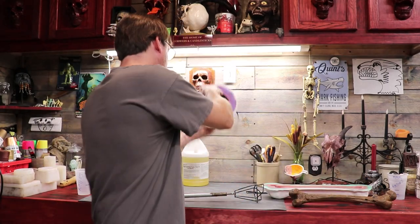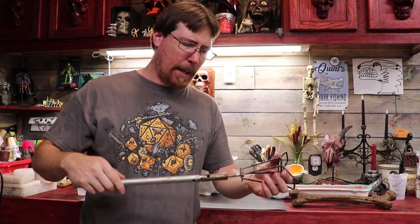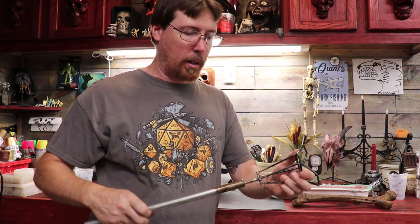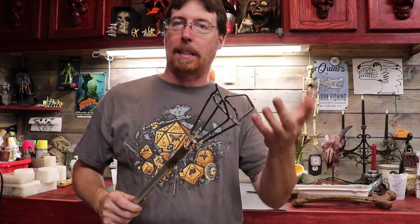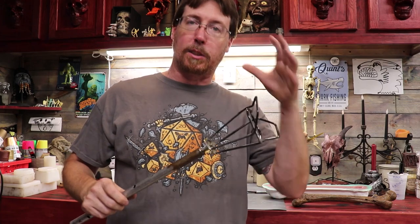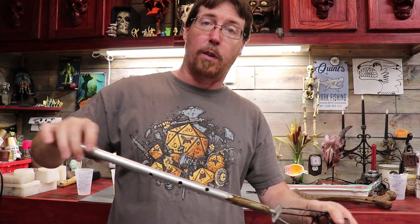We're going to do it the same way. I've got some conduit left over from the bone handles build. I went ahead and welded a nut on the inside, so I could screw this together and once they're screwed in, they're never coming apart. I want to foam up a skull, put this in the head, and this should lock it into place. This is just a food service tray — you put foil in the trays with a little candle to keep food hot at banquets. I cobble welded everything together, made it where I could stick this piece in and thread it in. So once the skull and femur are done, this will be the femur bone, and I've got some holes drilled in so the rigid foam will get in there.